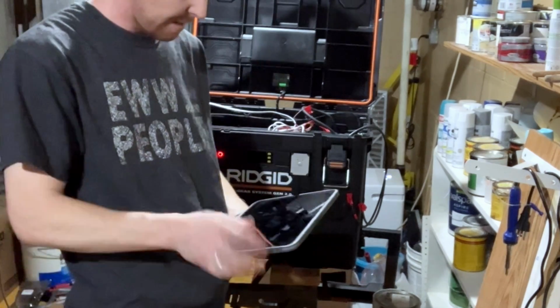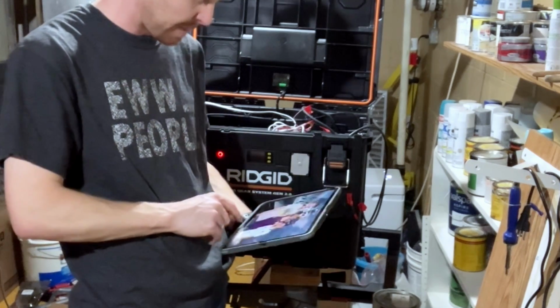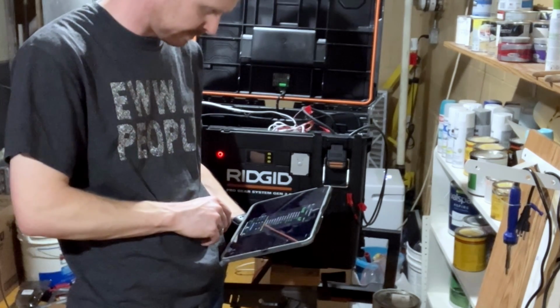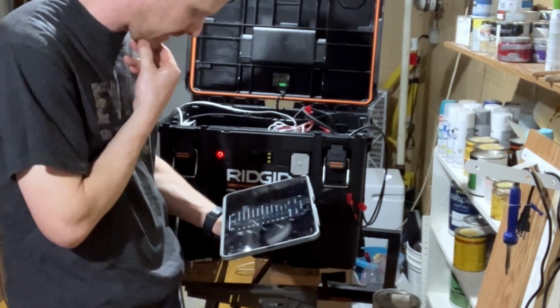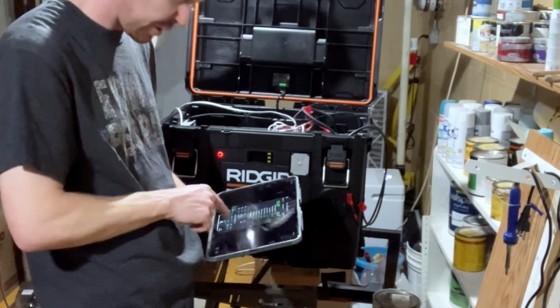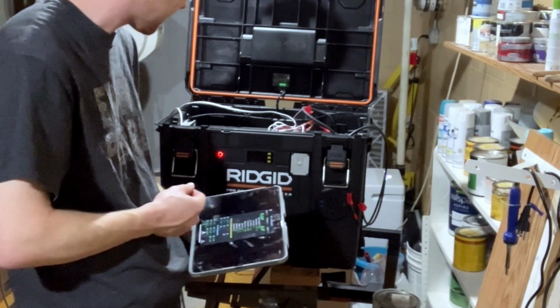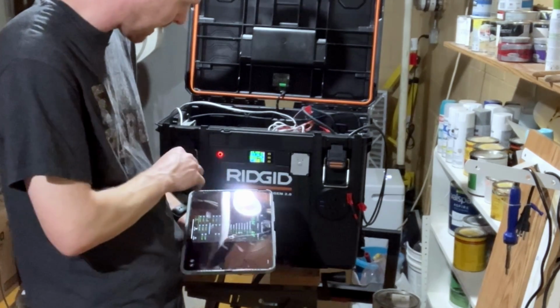You know, I might have some overcurrent settings in the BMS. I do. Protection, discharge, overcurrent. And I have the battery set to 120 amps discharge. So it should come back on here in a few seconds. So there's going to be a lot of different protection features that I'm going to have to look at dialing in.